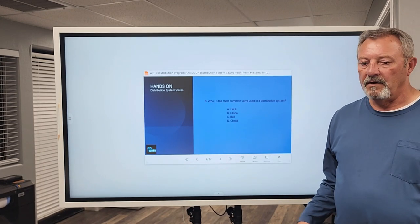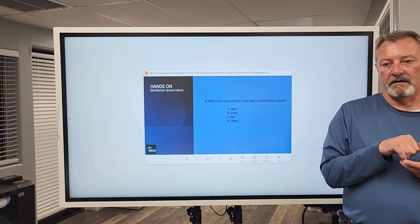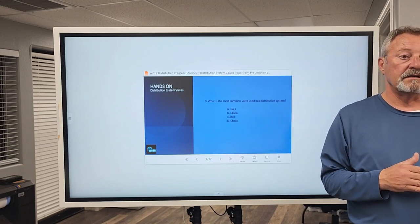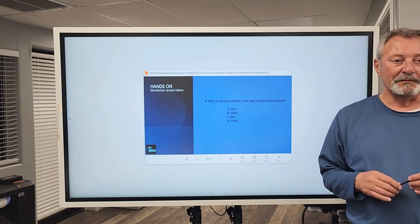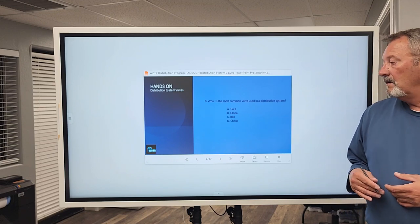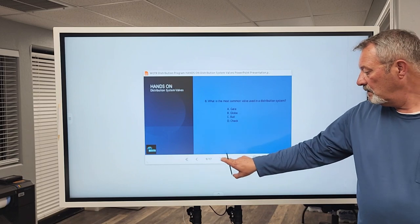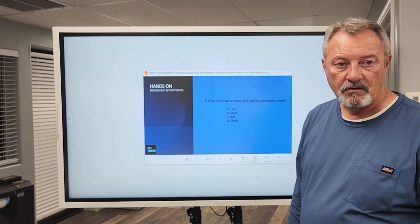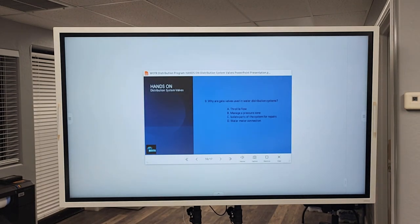So these ball and plug valves are the valves that are just upstream of the water meter in our distribution system. Every customer with a meter typically has a ball or plug valve just upstream. Some of these we call angle stops. We've gotten pretty good at replacing those. They come in various sizes, various styles. So it's a ball valve, an angle stop, and the cool thing about those is they're quarter turn valves as well.